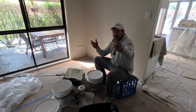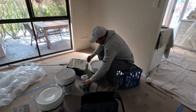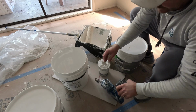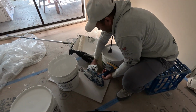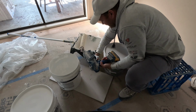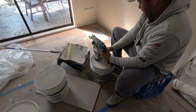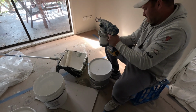And when I did switch this over to the ceiling paint from the sealer, this was all blocked. So maybe it wasn't getting a good flow of paint. So I've cleaned that out. We're using a cleaner paint. This little filter just goes in here, like that. You don't actually have to clean the entire gun out when you switch the paints. But I did just clean the cup and the filter.